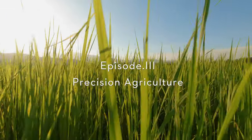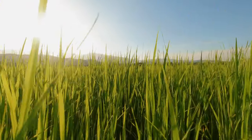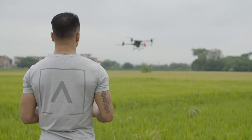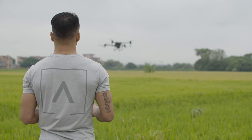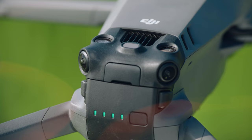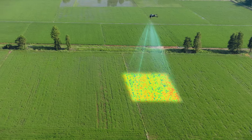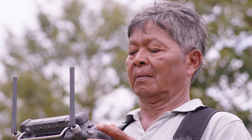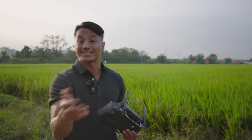Crop growth is affected by various factors such as sunlight exposure and soil quality, so even within the same field, the growth of crops can vary. To apply pesticides or fertilizers precisely, first use a multi-spectral drone to survey and map the area, then have the data analyzed through DJI Agris Intelligent Cloud, producing a prescription map. Using this map, the T40 will apply more fertilizer on areas showing weaker growth and less on those showing better health. This reduces farming costs by allocating resources only where needed, and the prescription map is a great tool for identifying crop diseases and estimating yields.